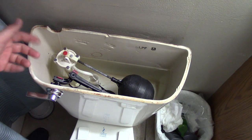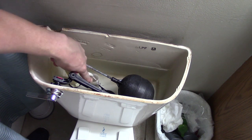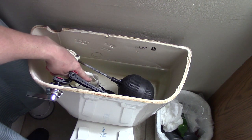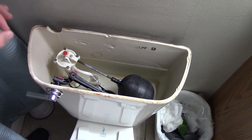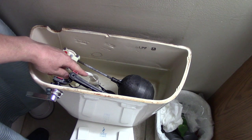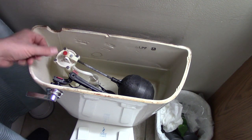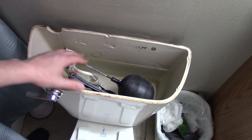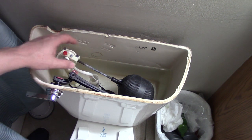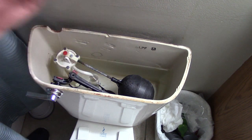Now, I'm talking about the water height — that's what we're going to be adjusting. This little tube here, which you can kind of barely see, that's our overflow tube. The water needs to stay just below the top of that. As long as this overflow tube is installed right, it's going to be well below this dimple here, and then your flush lever over here too. Because if the water keeps running, it goes down there and just goes through the flush — not coming up and over onto your floor.